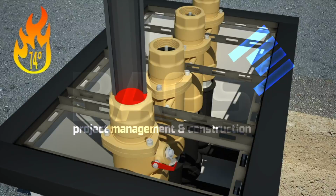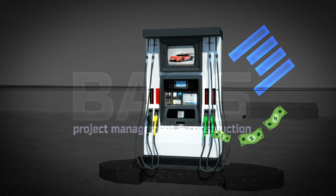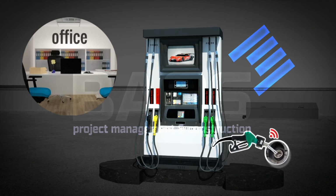Site automation system is a complete system where you can control and check every transaction from pump and tanks. All liquid fuel dispenser sales are saved in the system instantly online. All transactions are recorded in the electronic environment. All customers who have customer and vehicle identification units are known by the system. The system manages the usage limits. The customer or the vehicle is given the right quantity of the right fuel type.